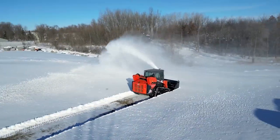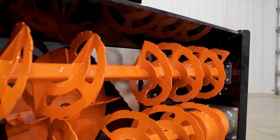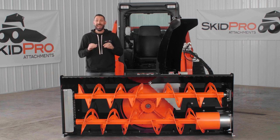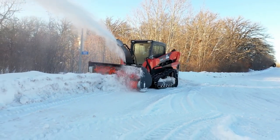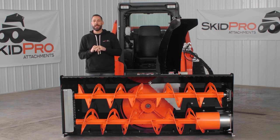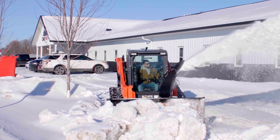Here's where we really separate from the rest of the pack. There are very few double auger blowers for skid steers on the entire market, and none have the beefiness of this unit, carrying two massive 16-inch diameter tight spiral augers. The quarter-inch thick, heavily gusseted and serrated steel augers deliver 532 linear inches of snow-eating power — that's over 44 feet of auger flighting. The serrated auger design takes aggressive chewing of ice and compact snow to the next level, meaning faster blowing speeds and overall better performance.